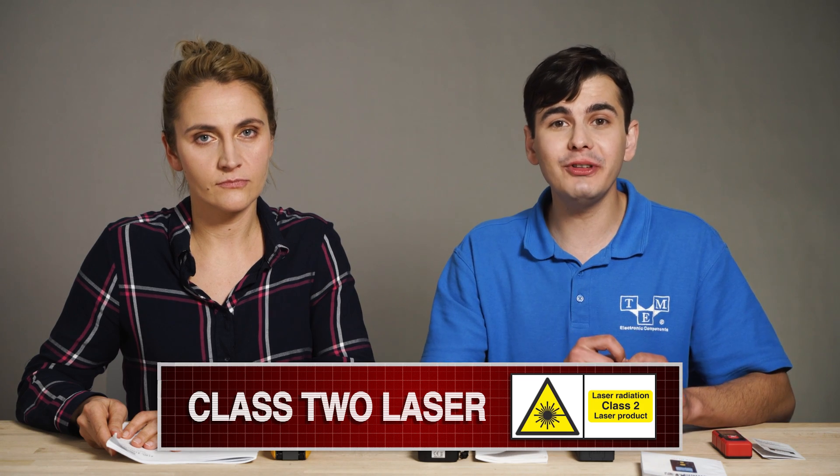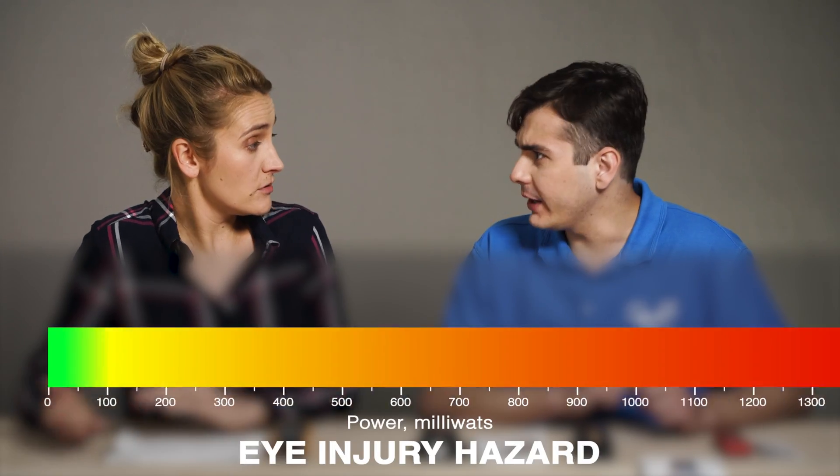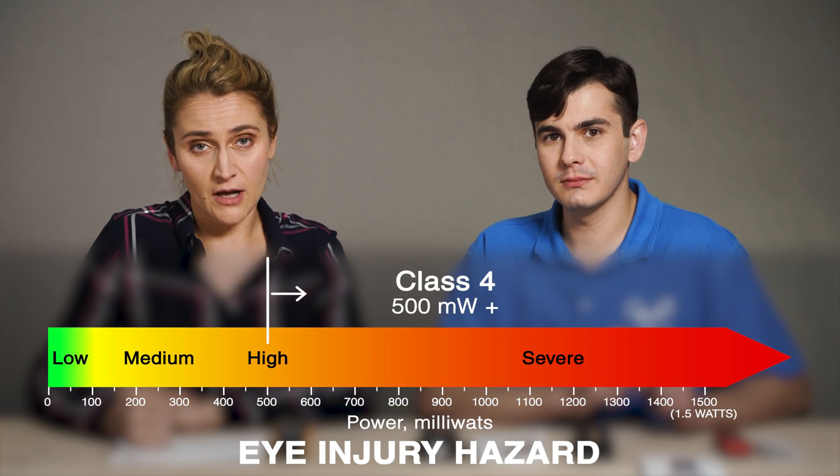Before you use any electric device, you need to read the safety manual. A Class 2 laser — the laser you'll find in most LDMs, not the red pointer — is defined as safe for normal operations. Its output is less than 1 mW, which is relatively weak and will not damage your skin. But do not deliberately stare into the beam or point it towards airplanes or any other moving vehicles. You will distract the driver or pilot and can go to jail, and you may damage the retina — the film or image sensor at the back of your eye. As for the measuring tape? Simply pay attention to your fingers when it comes back.